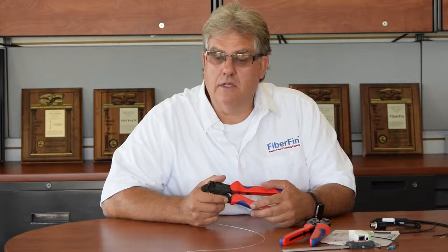In this video, I'm going to talk a little bit about what is Light Seal. Well, Light Seal is a patent that FiberFin has that is very unique to plastic optical fiber, because it is the ability to deform a connector or a ferrule around the plastic fiber and hold it. And this is really handy when you're using a very small ferrule, or if you have a field installable connector.